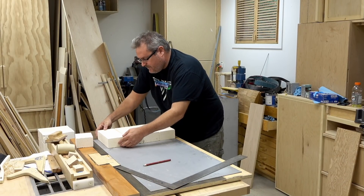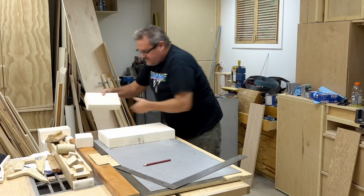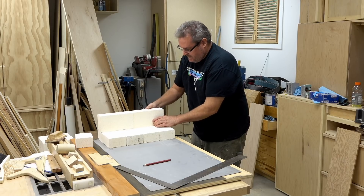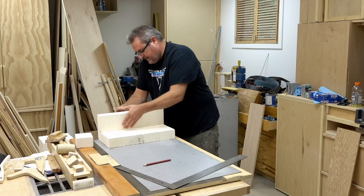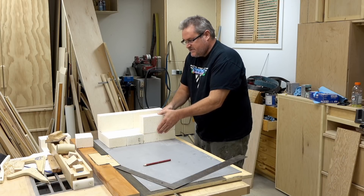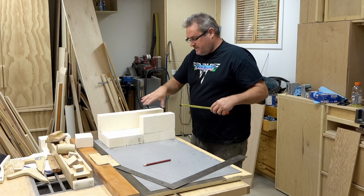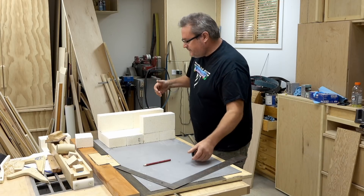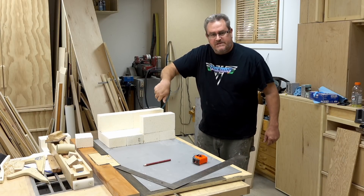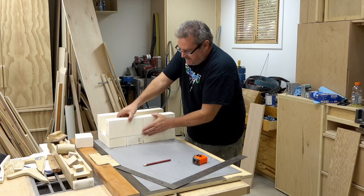This is basically the bottom right here, and for the sides they'll be single bricks — which are conveniently the same length as two bricks end to end. There'll be two more on the other side, which leaves me with a chamber that's not huge: four inches wide and four and a half inches tall. The element will wrap from this side around, and the leads will go through the side to the controller.